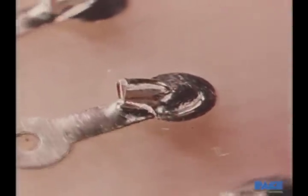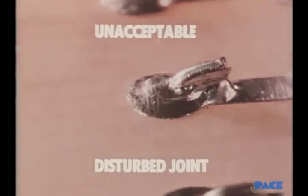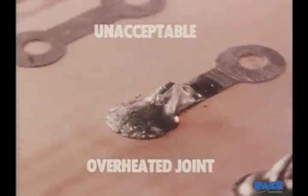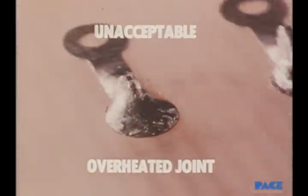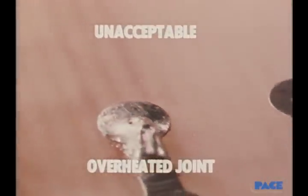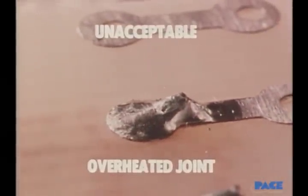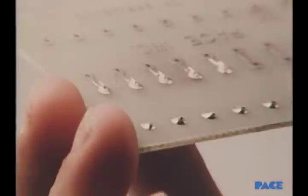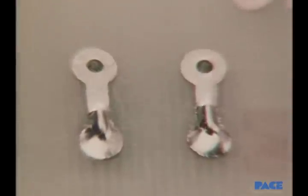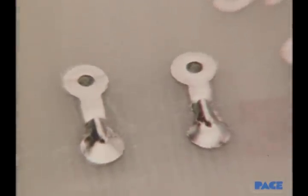This joint shows the other main characteristic of cold joints — a surface that looks frosty and granulated. Another unacceptable joint is the disturbed joint. It's also frosty and granulated, but here the cause has been movement during solder solidification. This is an overheated joint. It has a chalky, dull, or crystalline appearance and may show pitting on the surface. It's often the result of repeated efforts to repair a joint that won't wet properly due to contamination or lack of sufficient flux. A good way to inspect the joint is to roll it around under an overhead light — the movement directs the light on every spot and will quickly reveal any pits or discontinuities on the surface.